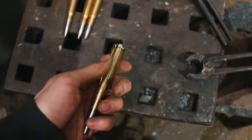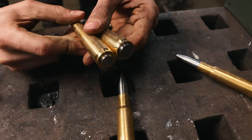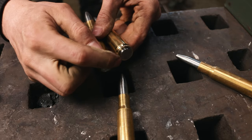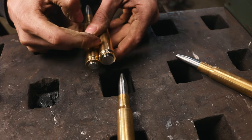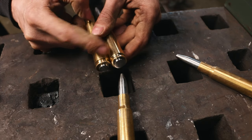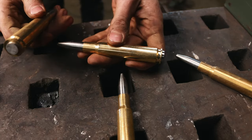Check it out. This is the new and improved center punch. I don't know if you can see this on camera, but this is actually now a shoulder here — so this is half inch and then goes out to about five eighths of an inch. That should catch it. That's how I made the original one, versus this one where this is just half inch all the way through. So let's try it out.